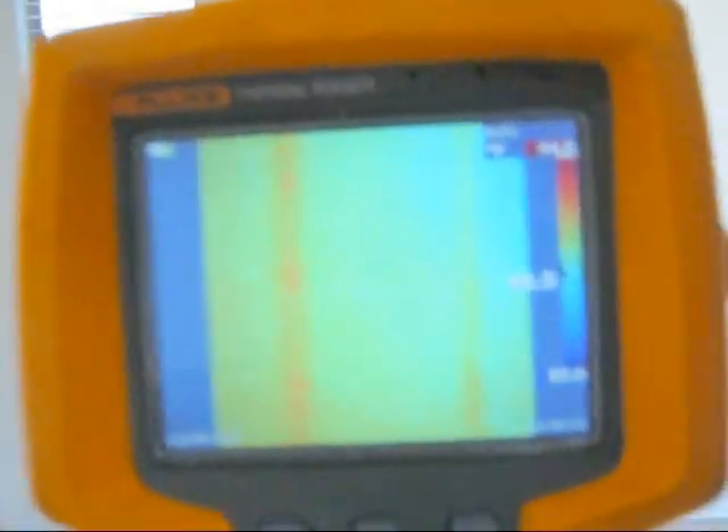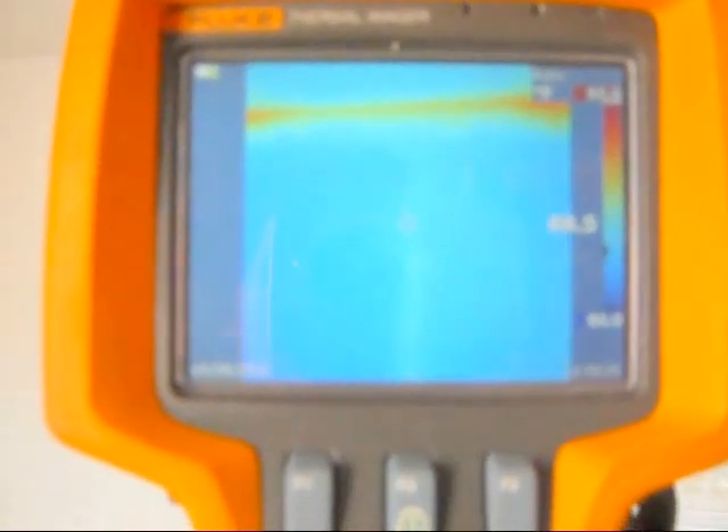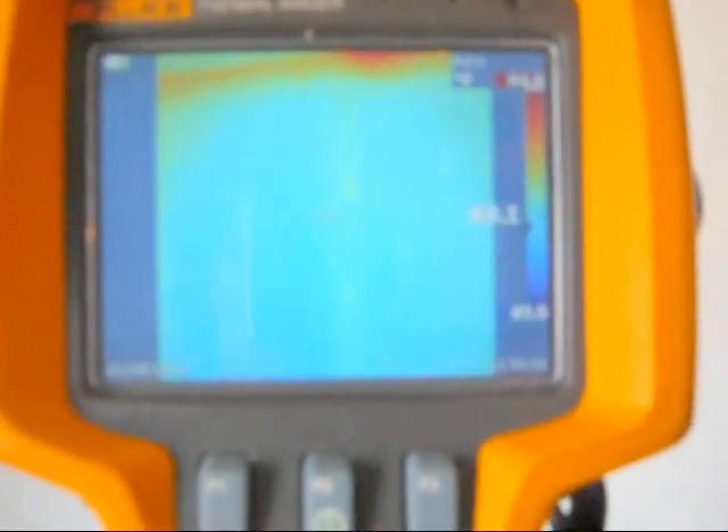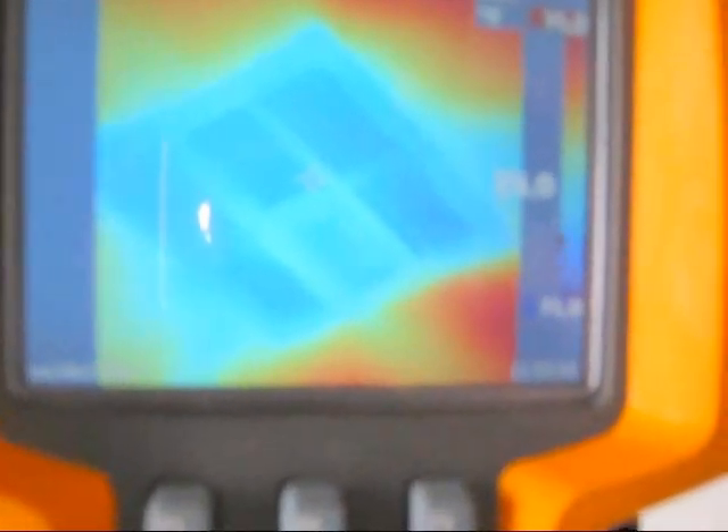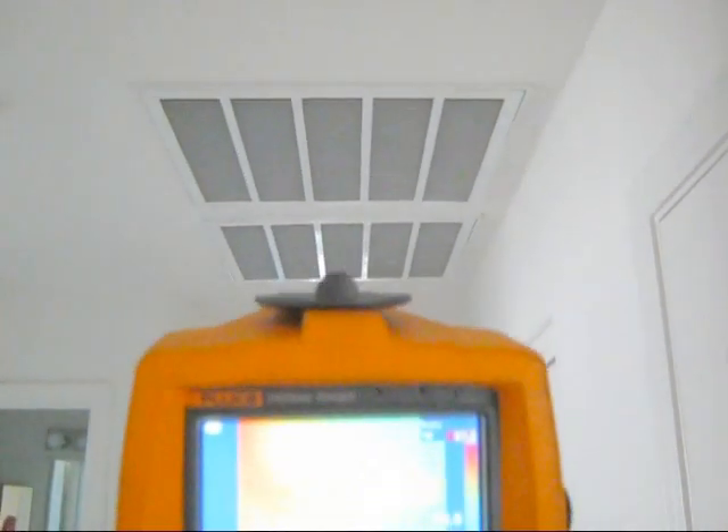With this camera, you can also look at walls and ceilings, looking for missing insulation. Any wood in a wall will transmit a small amount of heat, so that will make it appear to be like an x-ray — although it's not. It's just the studs appearing a little bit warmer than the rest of the drywall. We'll also verify our AC is working — you can tell how cold the air is blowing out and compare that to the temperature of the air going in, so we can tell if we're getting adequate cooling in the home.